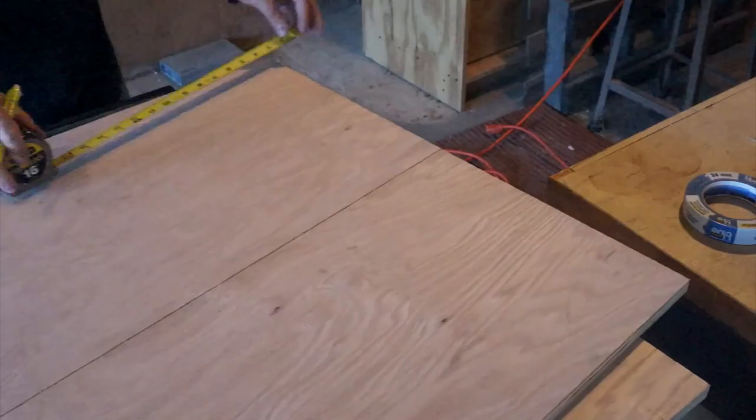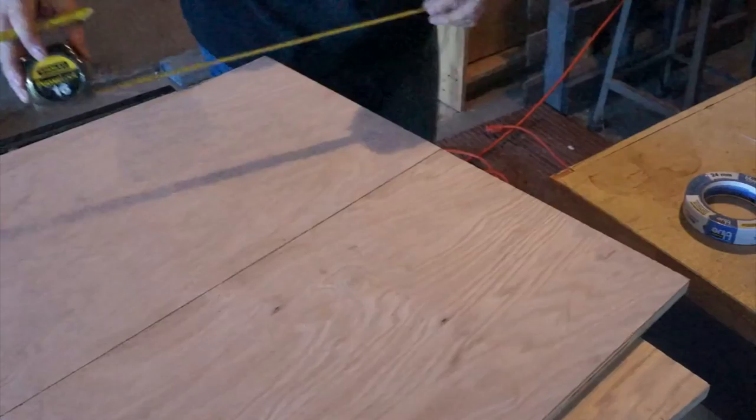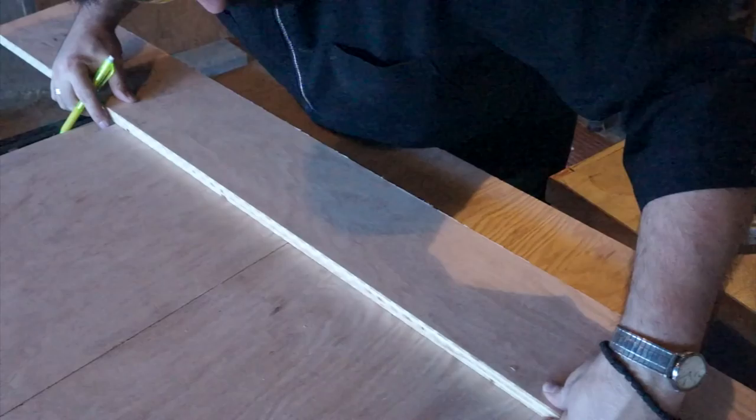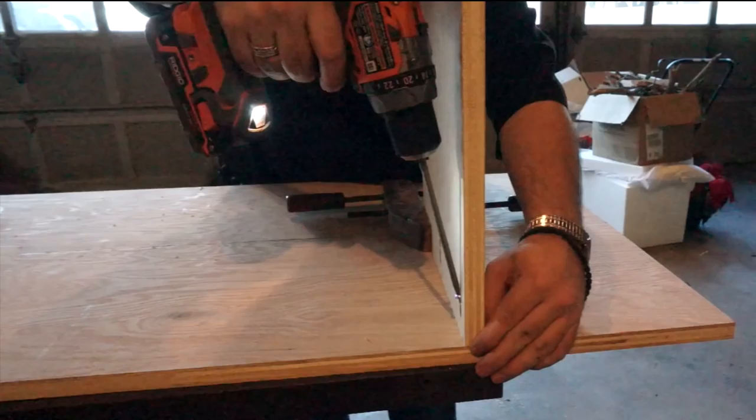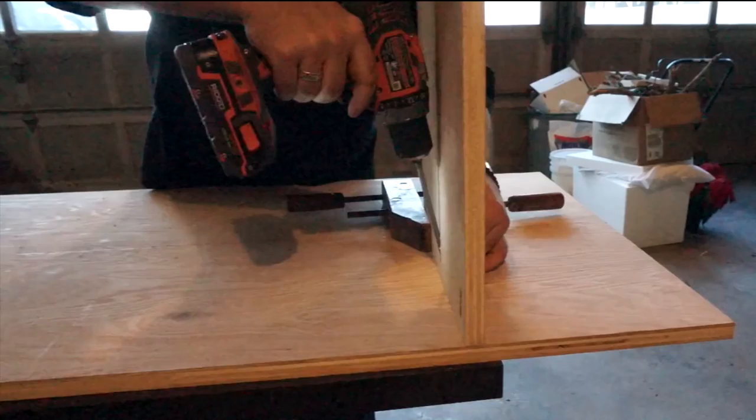At this point I'm doing what I would with any traditional joinery, which is laying out where the shelf would go. If I was going to cut a dado to hold the shelf, I would be doing the same thing — laying out exactly where I wanted to be. Then I'm taking a straight edge, just using another cut-off piece of plywood for the factory edge, and simply marking the line. Then I can take my first shelf and use a hand screw clamp as a kind of third hand to help hold things up. After I make sure everything's lined up, I begin to insert the screws.